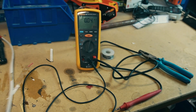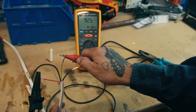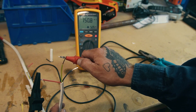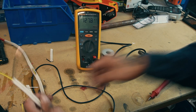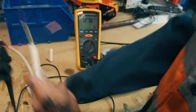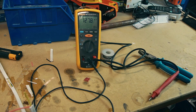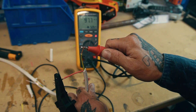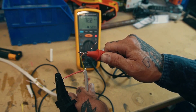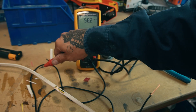Now say the sun comes out and the cable dries out a little bit — not fully. We're up around 150 mega ohms, so that's a pass, but there's still moisture present. If we go as fully dry as we can make it, we're still sitting at a lower rating than the original — there's still probably moisture that's tracked in through the copper.